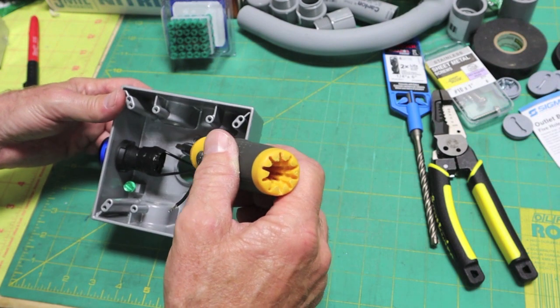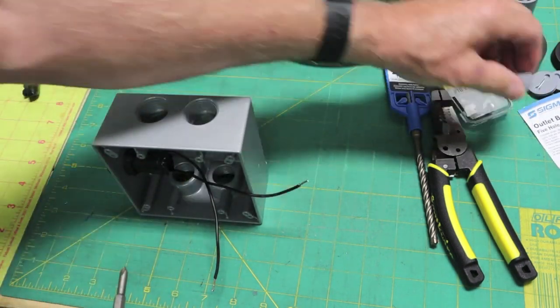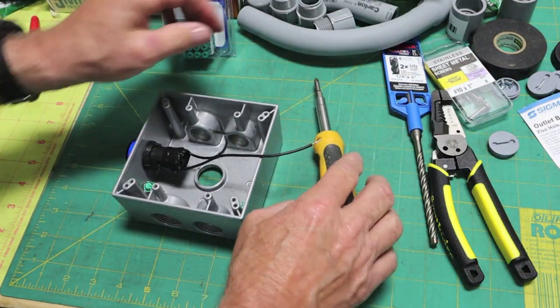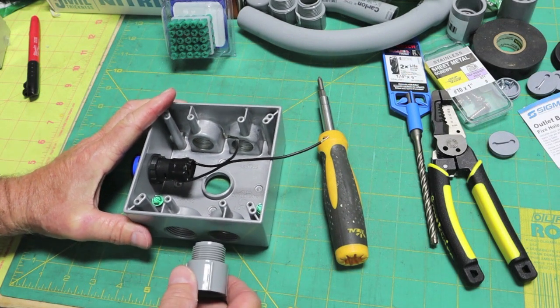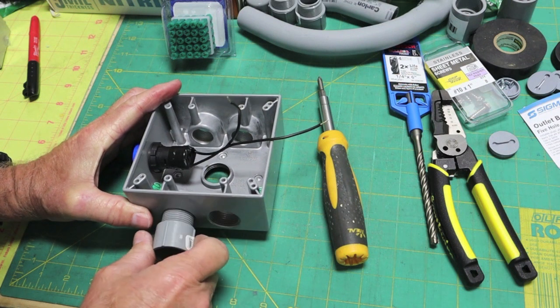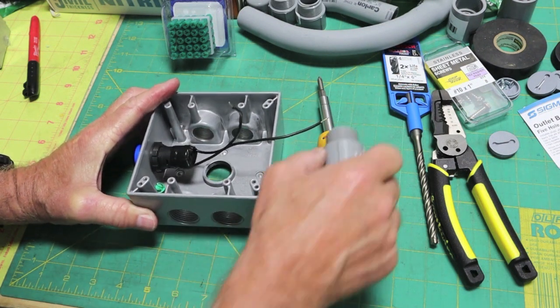For rain tightness, closure plugs are to be sealed with a silicone sealant compound — and all the plugs come with it, so I'll be doing that. My 120-volt feed is going to come in, and I don't know yet if it's going to come in on the right side or the left side and loop around — either way, I haven't got there yet.